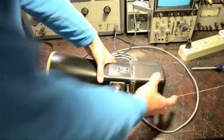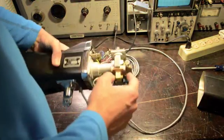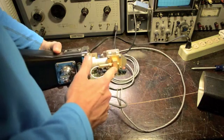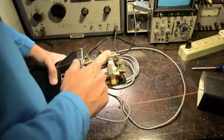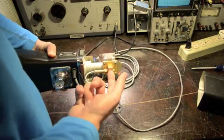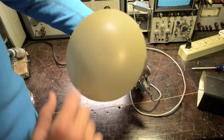I'll take the cover off this thing. As you can see, there's a little board in here, and here's the microwave oscillator, and there is the mixer. This oscillator actuates the diode on this mixer, and also radiates out here where there's a horn antenna that's flared out the front.